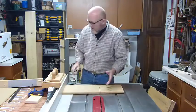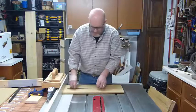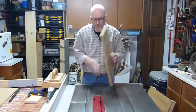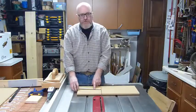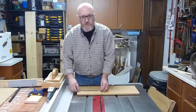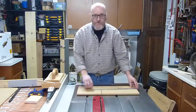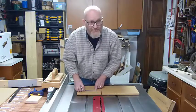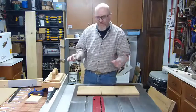For example, if we need 14 inches of a board for a project and the board is too long, the first thing we could do is turn it around and cut the short side off. That's still a bad idea on this particular board because it's too long, but if we only had maybe two inches on this side, we could move the fence over and instead of cutting the 14 off, we cut the two-inch piece off. You just have to account for the width of the blade — so if your board is 16 inches long and you need to end up with a 14-incher, you're going to cut off one and seven-eighths instead of two inches to account for the blade. So you could just turn it around depending on the shape of the board, but that's still not the best idea.